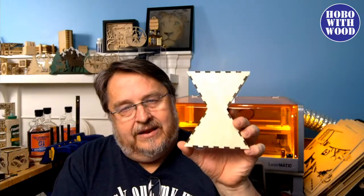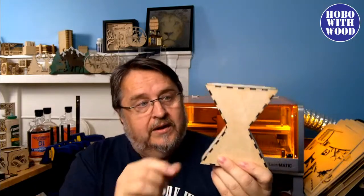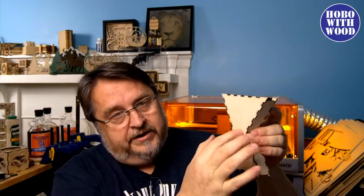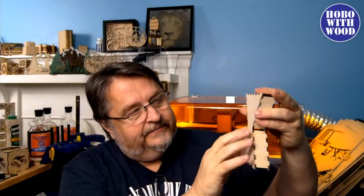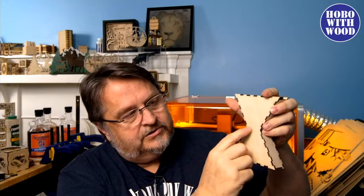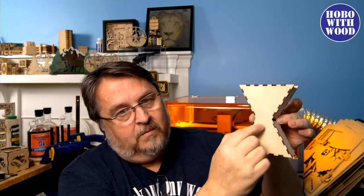Well, the only way that can be true is your laser beam, and this is exaggerated. I went and got the specs, 35 by 22, and scaled it up by a value of 100. So this is 100 times the width at the optimum here. So it's actually 22 millimeters and 35 millimeters across here at its intersection. That would be the perfect spot size on my laser.